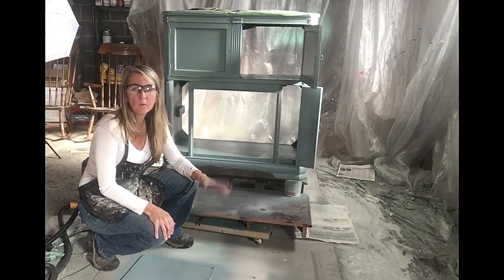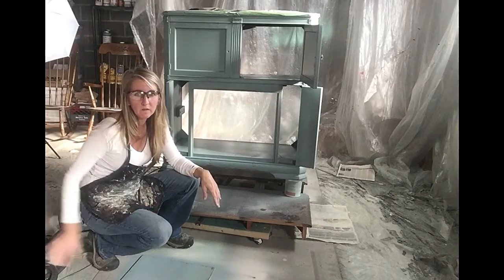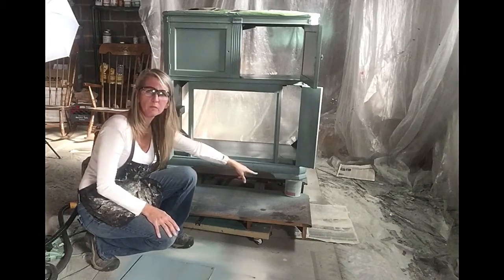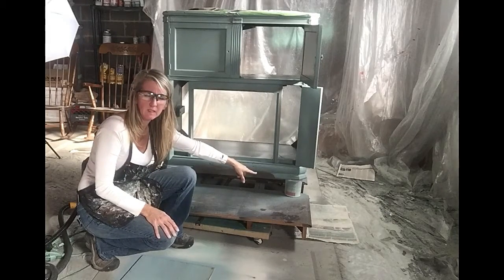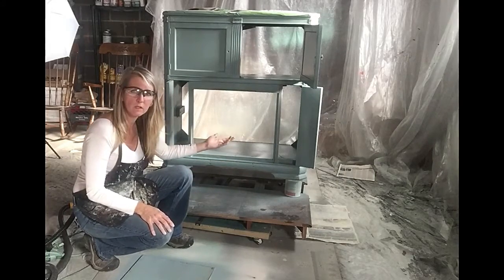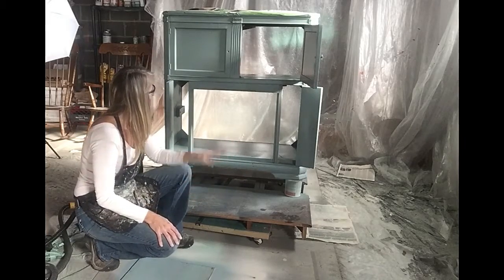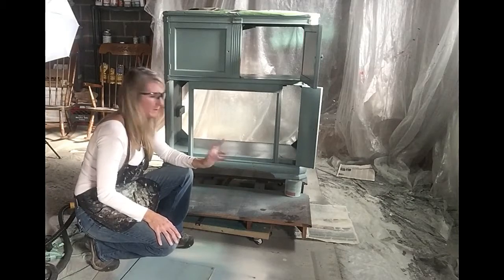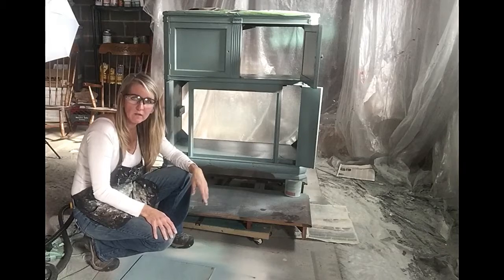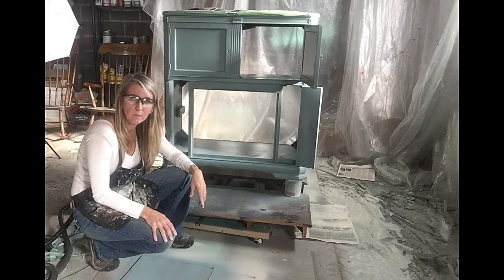Okay, that's how quickly it is to spray using the Wagner. You'll notice I always put my furniture upright on old paint cans. That way I can make sure I'm getting the bottoms of my pieces really well, especially if they sit low to the ground. It's already starting to dry in certain sections, so I'll let it be, and it looks like I'm going to need a light second coat on this. So that's how simple it is to use a Wagner sprayer to spray all your furniture. Thanks for watching.